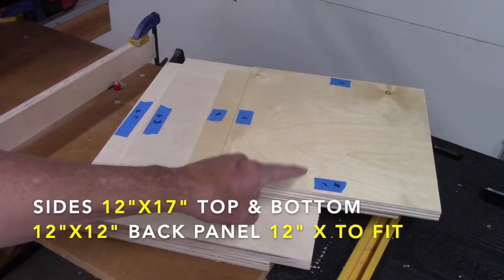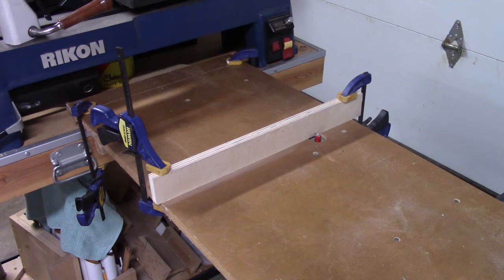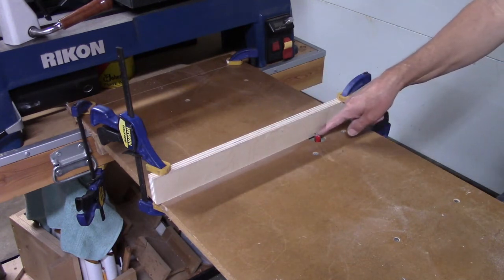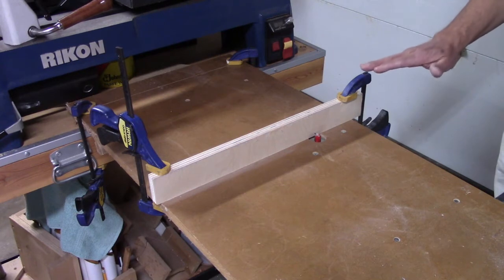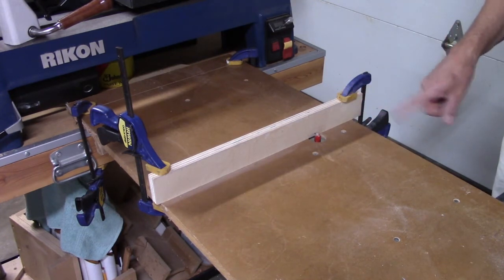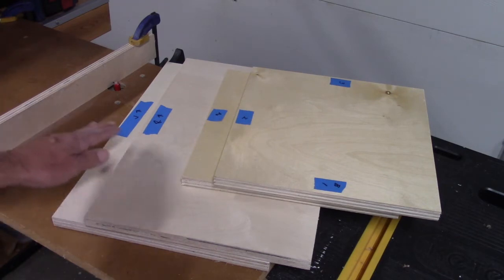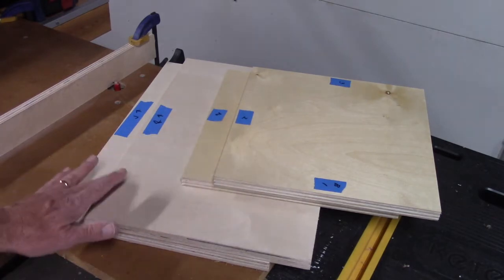On the tops that are 12 by 12, I put blue tape on three sides that would be routered. I don't have a router table, so a long time back I made my own router table with this piece of particle wood. My router is bolted into it, and I have a temporary fence — the blade is just touching the fence. When I pass through, it's going to cut that slot on all the sides I have marked. I've labeled the pieces one, two, three so I know I need to make three cuts here and one cut on each of the others.